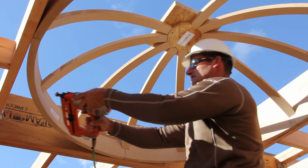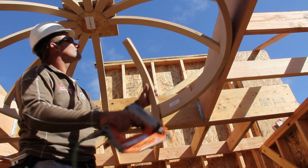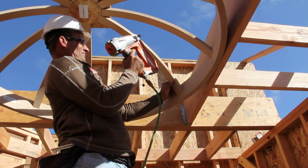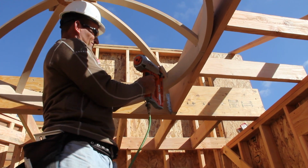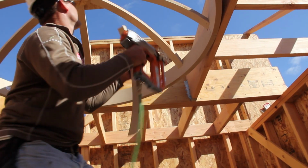When you drywall this, this dome becomes even more rigid, and you'll see that it can easily hold any weight you're looking for. Put any kind of lighting, any kind of chandelier there. If you do want some added support, you can throw a dome beam across the top and nail the dome tie into it. This is the Universal Dome Kit